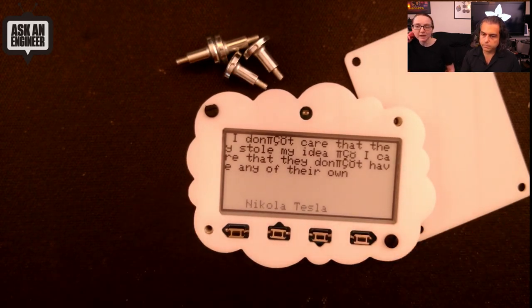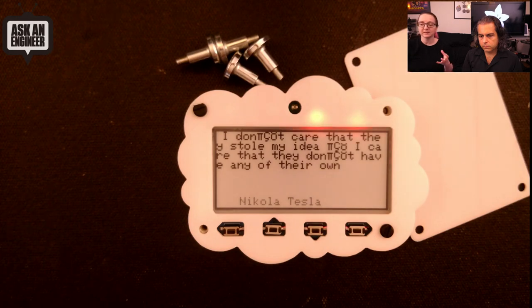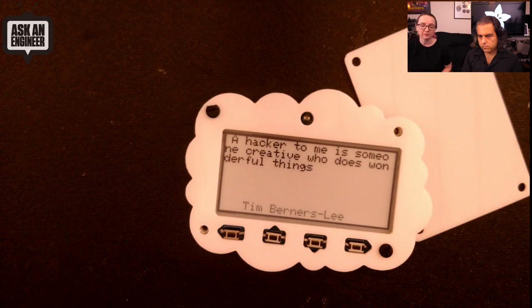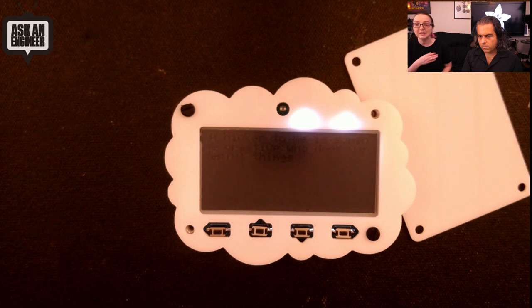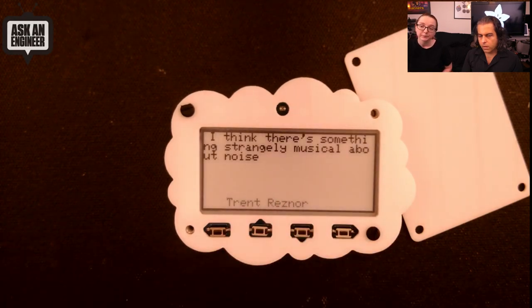Yeah. I'm going to do some math also to figure out exactly how many refreshes. But there are cool things we can do with deep sleep and light sleep. And we're also working on adding more sleep modes to CircuitPython. Right now we have light sleep mode. We want to add deep sleep. E-ink displays are great for deep sleep because, I mean, I'm obviously getting a quote every 30 seconds, but for a lot of projects, I think people need data updated every 30 minutes. Yeah. So if you can deep sleep for those 30 minutes, it'll last literally months.